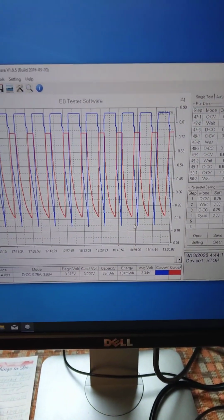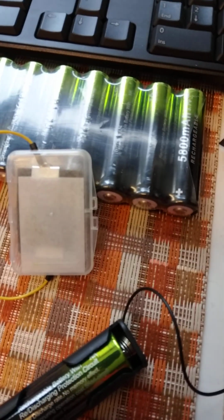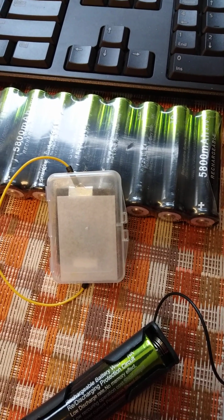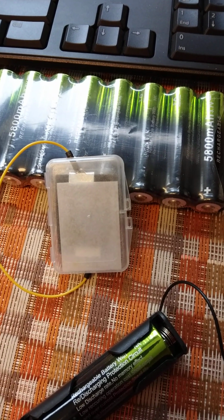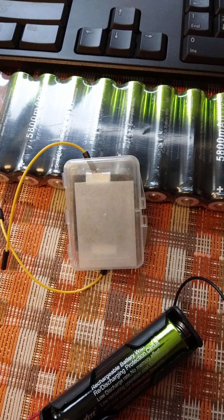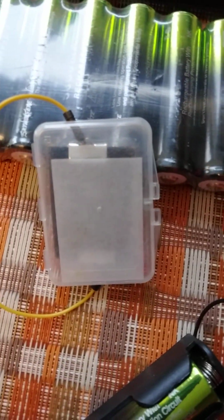Well, in any event, after 75 cycles, holding up very well. The mass balance before the run and after, before the total mass was 7.273, and that's with 337 milligrams of choline chloride urea deep-eutectic solvent with 5 to 7% mass of lithium tetrafluoroborate electrolyte. There's a piece of chromatography, paper chromatography.